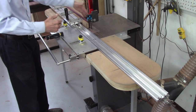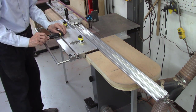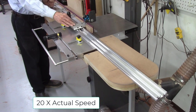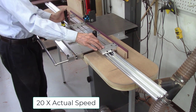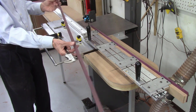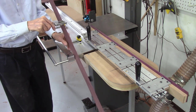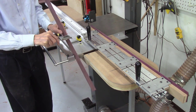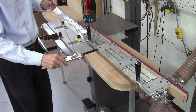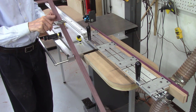That was just a piece of scrap to give me a flat surface. So let's cut another board now. I open my mag jigs, do one full turn for the kerf of the blade, and let's cut a board 50 thousandths of an inch thick. I sped this up 20 times actual cutting speed to reduce viewing time. Okay, here's this 36-inch long piece of Purple Heart — let's measure it. I got 51 thousandths, 50 thousandths, 52 thousandths, 51 thousandths, 52 thousandths. And the same on the other side: 52 thousandths, 51 and a half thousandths, 52 thousandths.